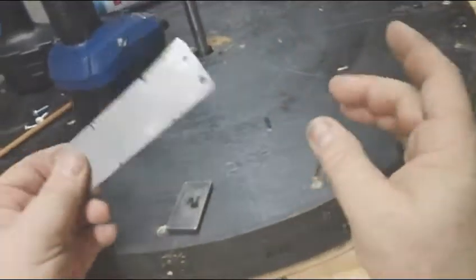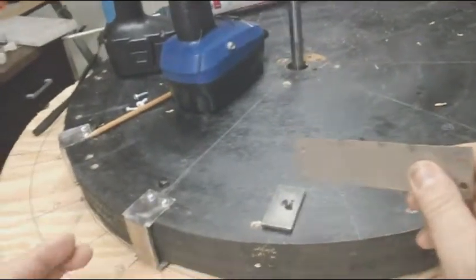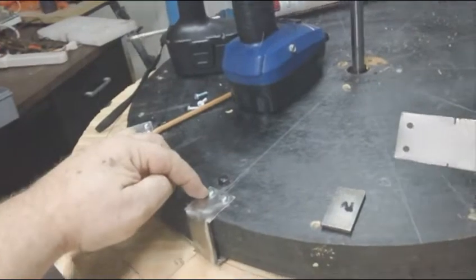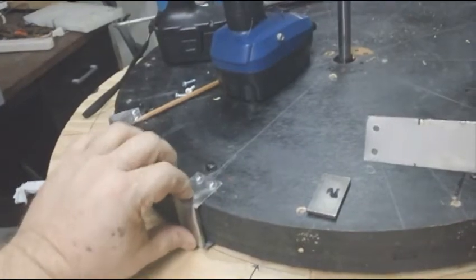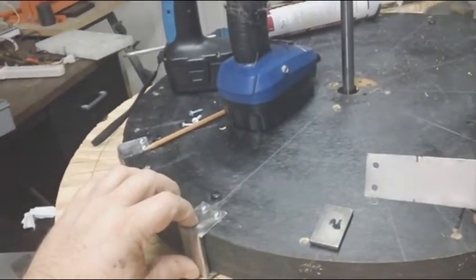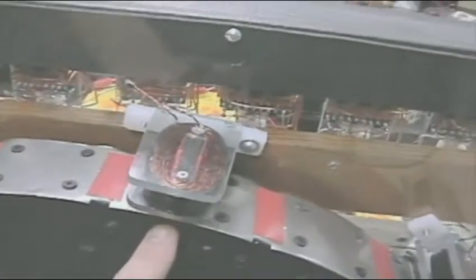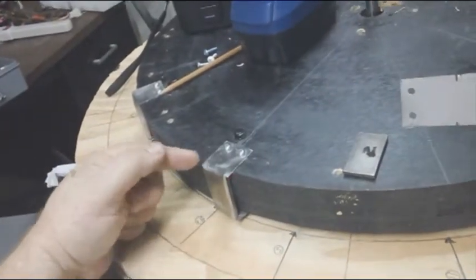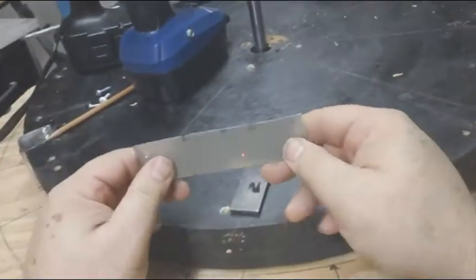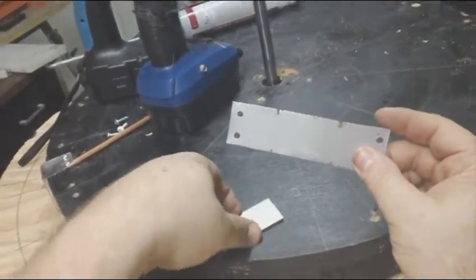And stainless steel is cheap enough, you can get a small piece of it and make these covers, and I've not had a problem with one of these coming loose. All the force is applied to the side, so it's screwed through here. So the stainless steel itself is actually the retaining mount. Early on I had a stainless steel strip, and I put screws in the face of them. They were working loose. They actually hit one of the things, but it was at a very low speed, so it didn't do a whole lot of damage like the first one did. Could have killed somebody.